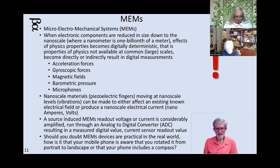And here's where MEMS comes in — micro-electromechanical systems. This means you're making tiny integrated circuits so small that quantum-level effects, at a billionth of a meter, are what you're measuring. In an accelerometer, you might have a microscopic crystalline tongue that sticks out inside a tiny coil. When you move the sensor rapidly, the tiny finger of material bends, registering either a change in field or producing a voltage. That's how accelerometers, gyroscopes, magnetometers, barometric pressure sensors, and even microphones work.